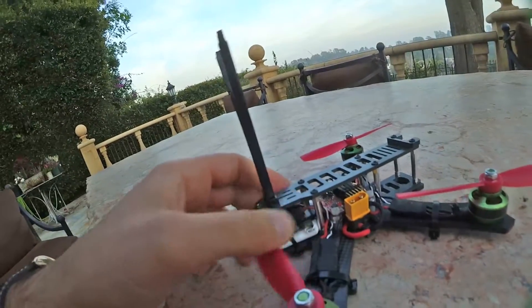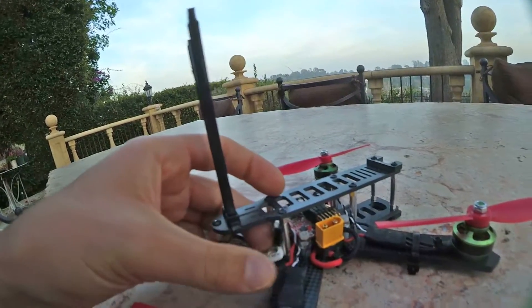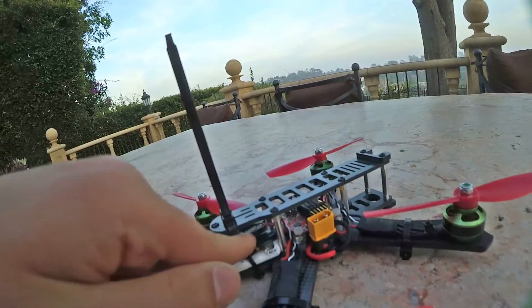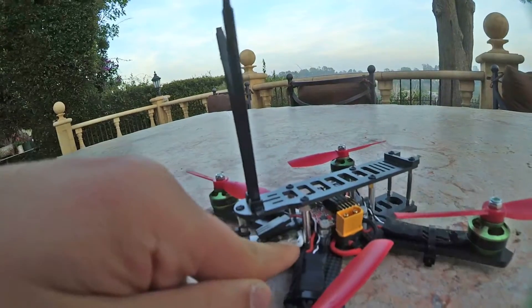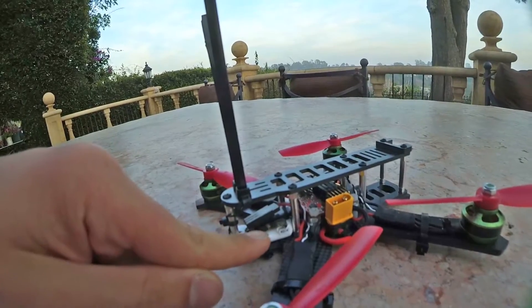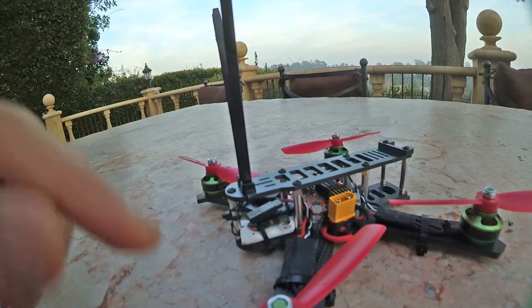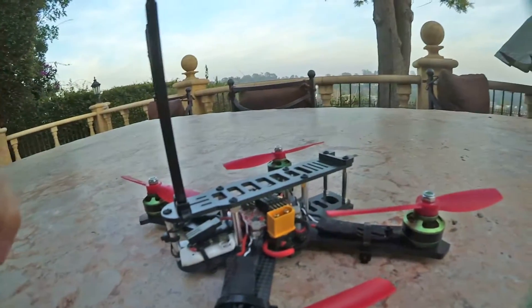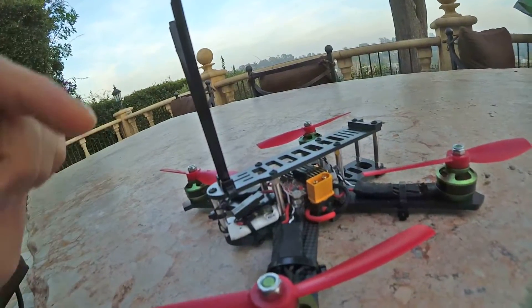Very clean install. You can see this tab here — this is to plug in any FPV equipment or LEDs, that goes straight to battery voltage. This little glued solid thing with the resistors in it is actually telemetry, your main battery pack telemetry, to the D4R2 receiver which goes to the Taranis. If you just calibrate your Taranis real quick, which is real simple to do, you get perfect voltage reading — straight telemetry to your Taranis. It's far better than any crappy OSD that never works.